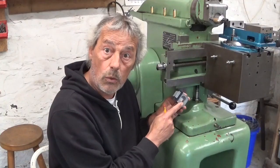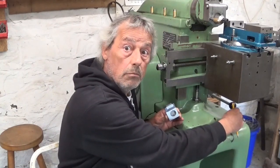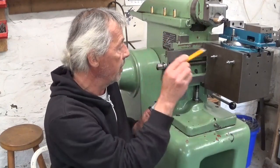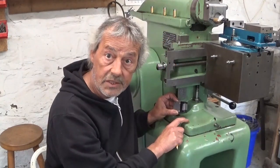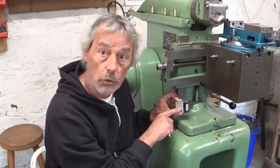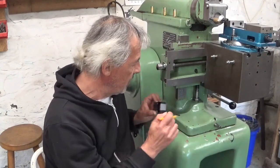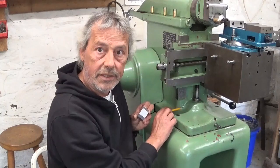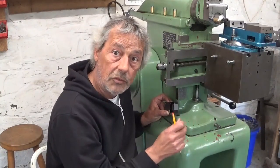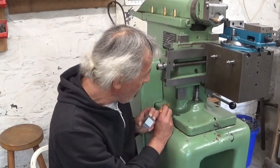My part has now the dimensions of this foot here of the main body. So now I'm ready to make this cutout here. This foot here is 4 mm thick. I already drew some outlines on my part here, just to help me out, and there are these radiuses all around. So I'm gonna have to make a tool that makes these radiuses.